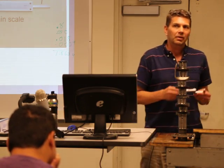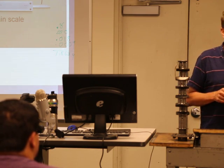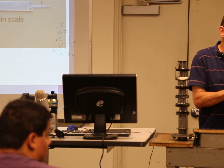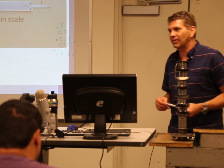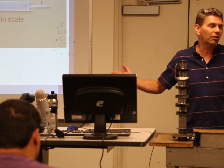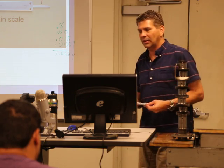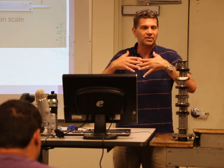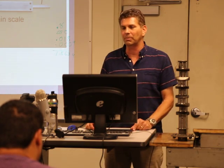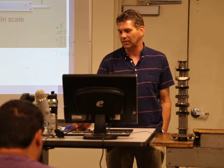In my shop, micrometers were calibrated at least once a year. We would have calibrated standards — a standard goes in here and you check against it often. But once a year a big trailer would show up and a technician would recalibrate every micrometer, recalibrate every standard, and do the whole job. Vernier calipers we did not do, because they just aren't accurate enough — they tend to flex a little bit, so they're good for machinist work but not for measuring crankshafts and aircraft parts.